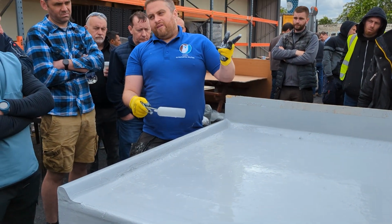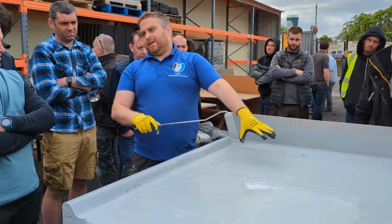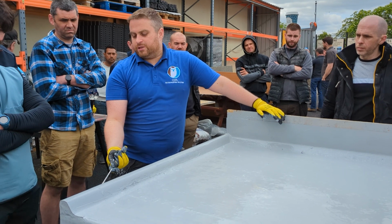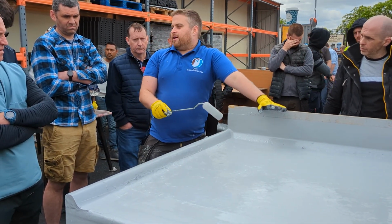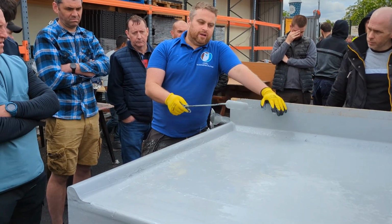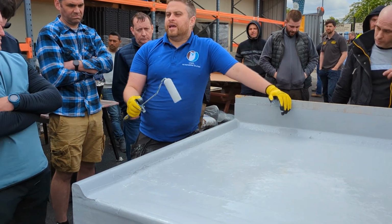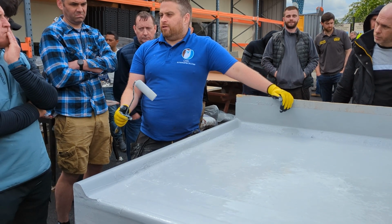Or if you're going over felt and asphalt, it requires matting, and you're going to be pushed onto this spec anyway. For simplicity, the best thing is 2.5 kgs per square metre will basically get you up to this spec all day long. That's your 25-year warranty. Keep it simple, and then if you want, you've got your dark grey top coat on there. That just prolongs the life, and once applied, in theory the system will last forever because it's a zero degradation coating, okay?